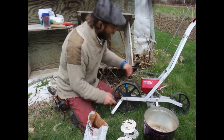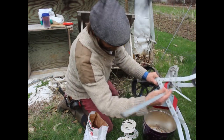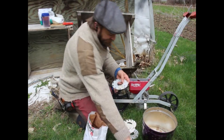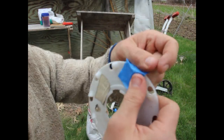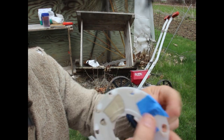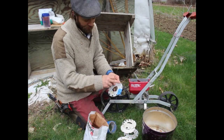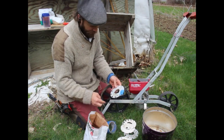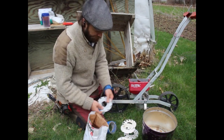So one option I would have to modify this would be to take tape and go right over every other one of these holes — push it down nice and tight, then tear it off so it's not on the back, otherwise it gums up the system. That would reduce my seeding rate by half. You can also buy blank discs and use a heated metal probe to create your own cups to catch seeds. Maybe someday I will do that since I do a lot of grain — make my life a little easier.